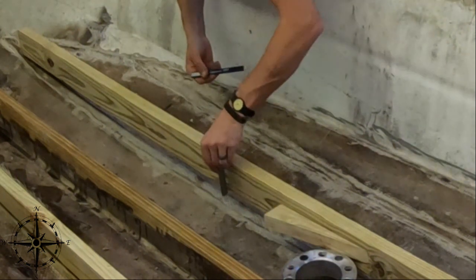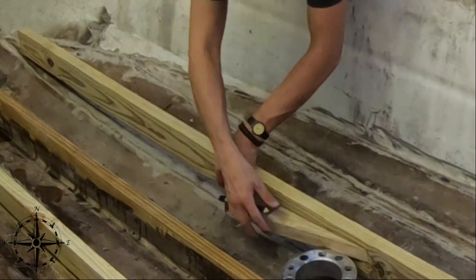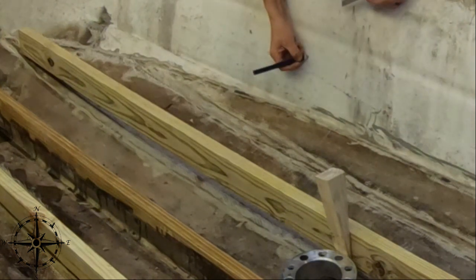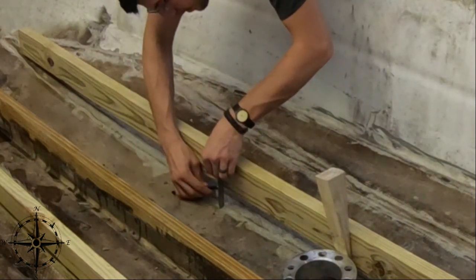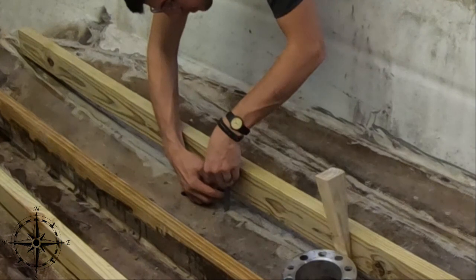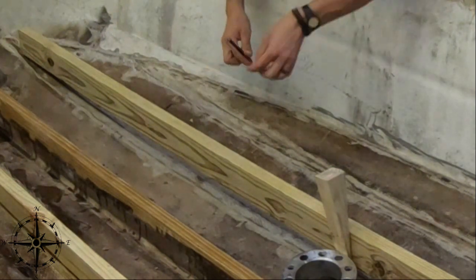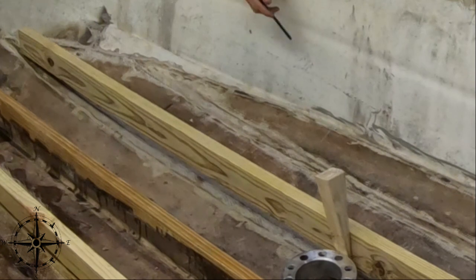The outside, or in my case the centermost section where the floor is dipping downward, that is your lowest, lowest point. It's pretty easy the way I do this. I take the measuring tool, set it on there. With a pencil, make a mark on the ruler at what I feel is the lowest point, and then look at it. I marked at 58, so I'm going to write 58 here. I'll wipe off the pencil and measure again in a little different spot. When I got 60, I move down a little, make a mark, and we drop down to 57. So it looks like 60 millimeters is our lowest point. That's pretty straightforward and pretty easy to measure.